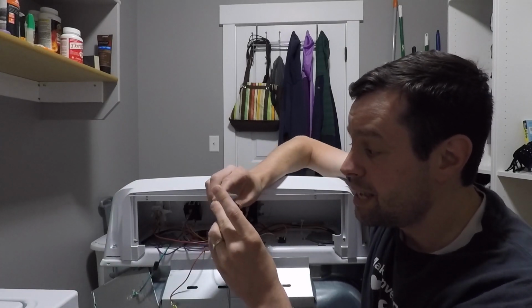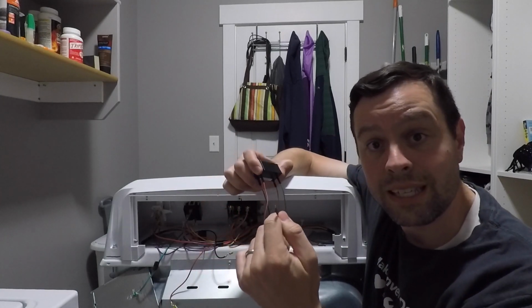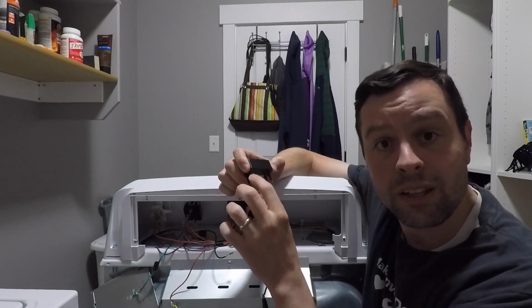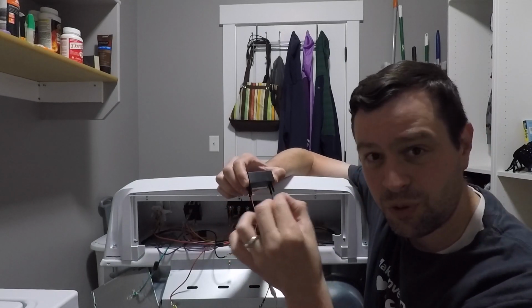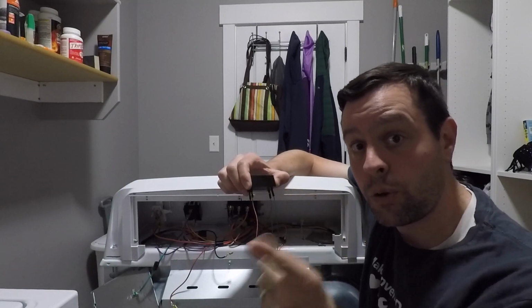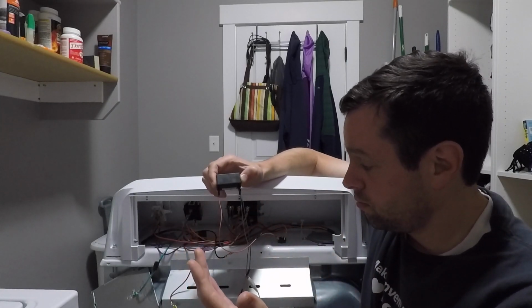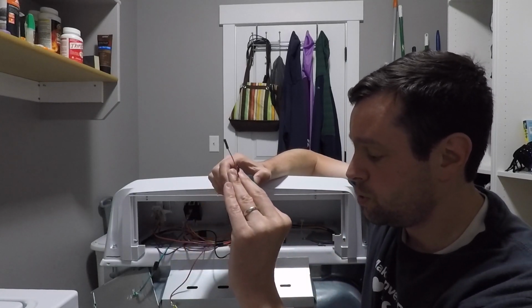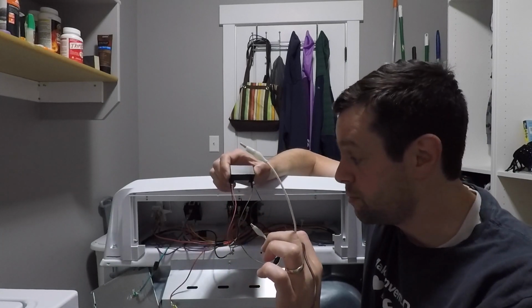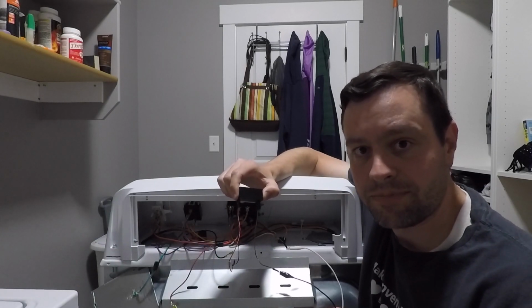Another tip on this IRM05 module is that these are just normal jumper leads that are female to male, and the female ends slip right on the little feet on the bottom, which works really nice. They're really nice and tight. Probably could leave it like that inside the dryer, but we're not going to. We'll talk about that at the end of the episode. So this is it. We're going to wire this up. We'll connect these two up to our RFM69 module, these guys up to the buzzer, and we'll turn on the dryer, see if we get some magic.